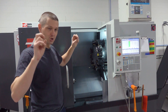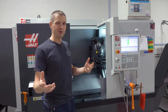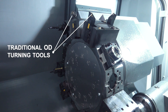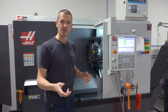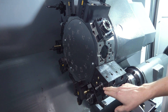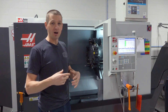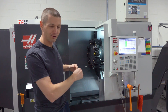We have the BMT — base mount tooling — 65 turret. Before we can talk about the cutting tools, we've got to talk about the tool holders. When you buy a lathe, the machine tool builder will probably include some different types of holders. Ours came with some traditional stick holders that hold one-inch or three-quarter-inch stick tools, just like a manual lathe. It also came with some ID tool holders. We've got the Micro 100 quick change system for smaller ID work — boring and threading — and you could use these to hold static drills. The Haas also came with two driven holders, also known as live tooling holders, which are absolutely awesome and really change this to what I like to call a horizontal mill.